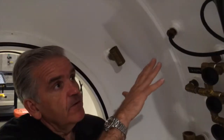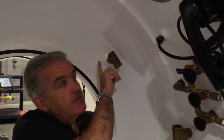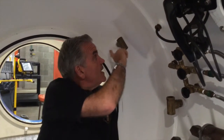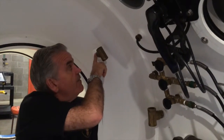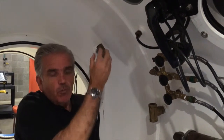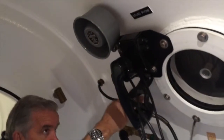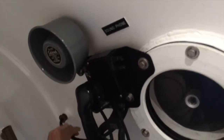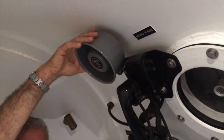Let's talk about some of the other penetrators that we have here in the chamber in DTC 1. This right here simply represents an open-ended fitting, again with a T, to prevent differential pressure injury. On the other side of this is our dead man valve — our spring-loaded ball valve. When we open that, it takes the gas from the inner lock and will put it into the outer lock. Moving over to the right here, you'll see this penetrator right here is for our communications — this is for your comm connector. And then you have your Calrad speaker up here — open comms.